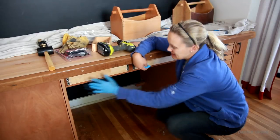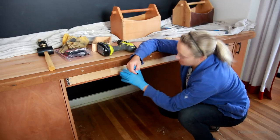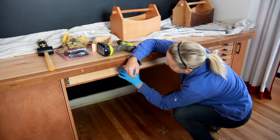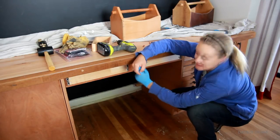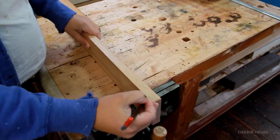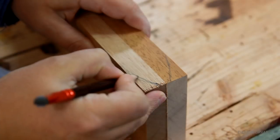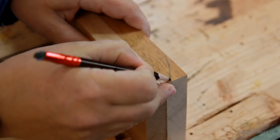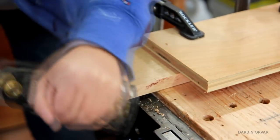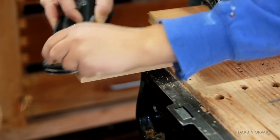The center unit is now in place. The next step is to add some face frames — I've got some nice solid mahogany going on top, which is going to create a nice sleek look. I decided I wanted the face frames to add a roundish effect to the front, so I curved the outer edges. To do that I used a plane, and of course you have to be careful going cross-grain so you don't tear too much off.